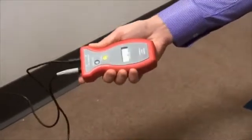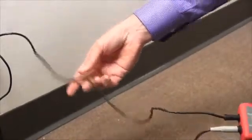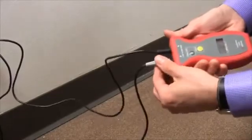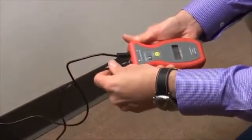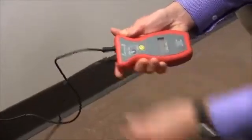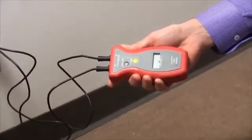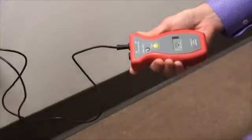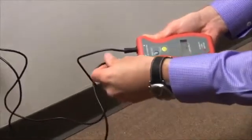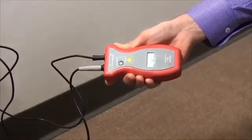So again, having the transmitter grounded with only one source providing a signal is very important. If we were tracing up to the end point being in a fuse box or some breaker panel, this would be a legitimate setup for the unit. Since we're tracing a wire, we want to make sure that we have the unit grounded. And that's the first step in completing wire tracing. We'll see you next time.